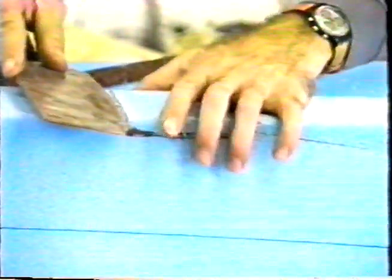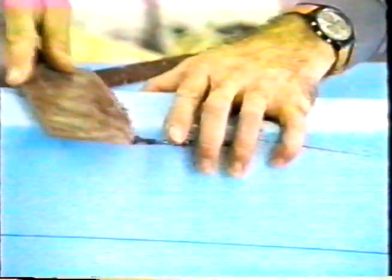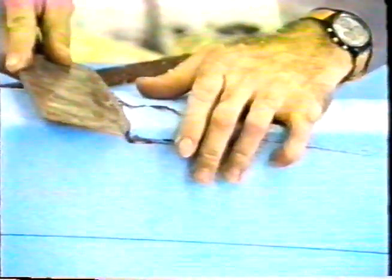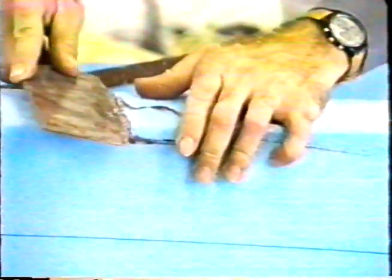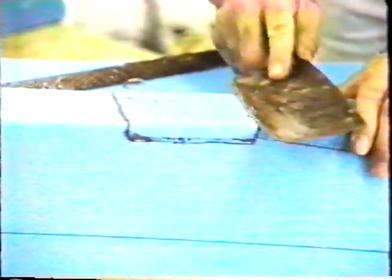The 5 minute is still a little rubbery. So we're gonna remove the 5 minute with a knife, take it off flush. And the same thing on the opposing surface. Same thing in the front.